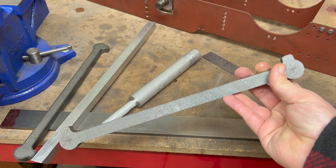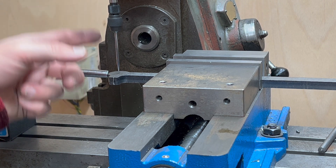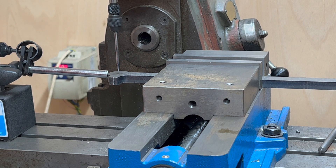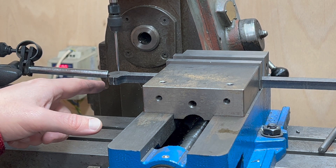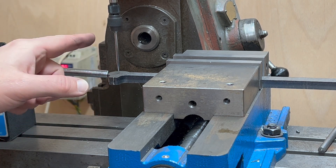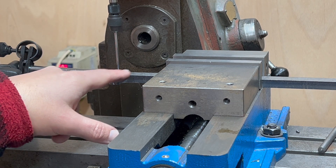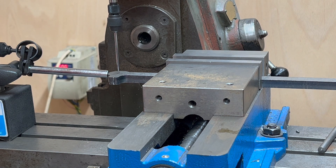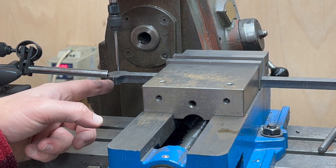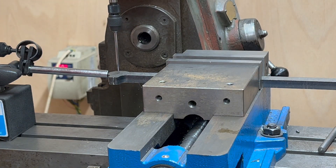So I think I'm going to try that. Given the level of accuracy we've been talking about — 15 thou over 10 and three quarter inches — this might seem rather agricultural, but we've got to bear in mind we're visually centered on this boss, and the most important thing is the distance between this hole and the next hole. So now we've centered it up with this center finder, it's straight on that laser cut cross, which is as good as any. I'm now going to drill that, ream to one-eighth, and hopefully move across the exact required amount and do the same on the other side.